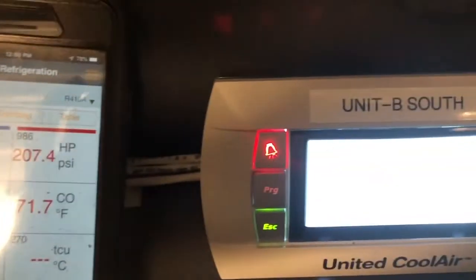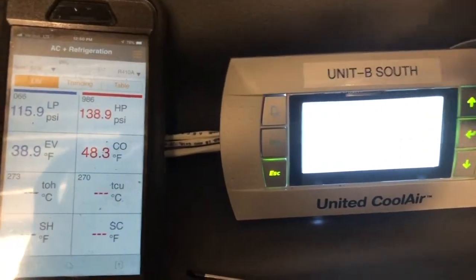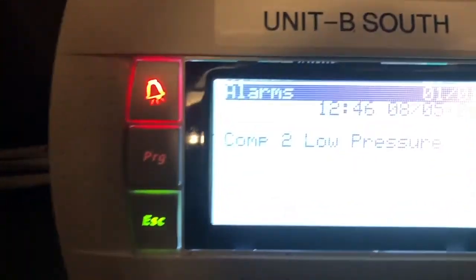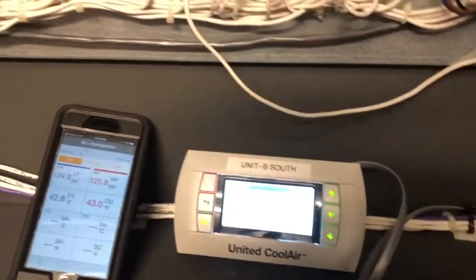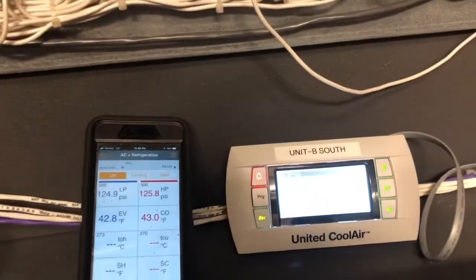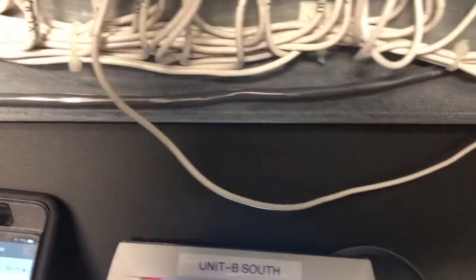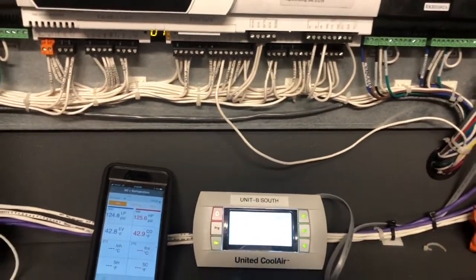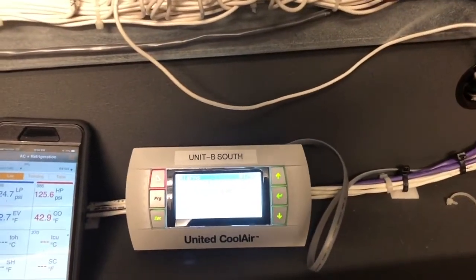The unit went into alarm. I let the relay go and the pressure will climb back up and neutralize. Pressing the alarm button — it still says 'compressor two low pressure.' This is not wired up correctly, and it's frustrating because all this tracing and troubleshooting led to finding it's not even wired correctly from the factory. I have to call the factory and see how to resolve this wiring issue. We do have a compressor that's low on gas — and that's compressor four, not compressor two.